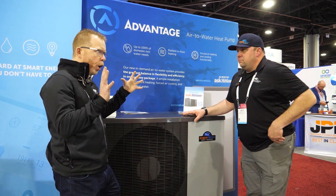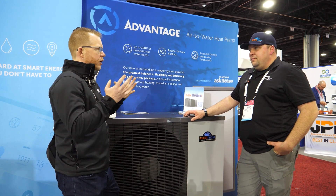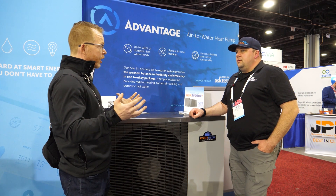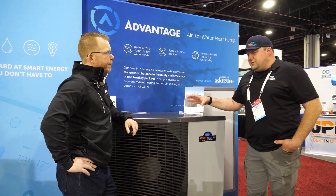If you look at it just compared to a boiler, which is what this is replacing, this could potentially be around $20,000 Canadian — that's roughly $17,000 US. The reality is this is now our heating and cooling, it's not a boiler. Compare that to a Lennox or a York system and we're actually the same price, but we're delivering BTUs for much less because we get way better heat transfer out of water than out of air. We're maximizing the functionality of the heat pump for domestic hot water, space heating and cooling. Even down at minus 13 or minus 25 Celsius north of the border, we're still just above 2 COP — around 2.2 COP — which is a really good efficiency for a heat pump taking care of your largest energy usage in your home.